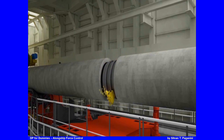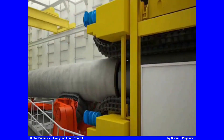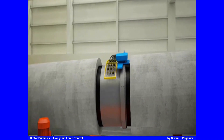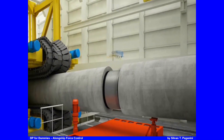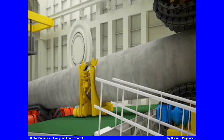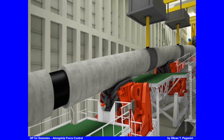In every pipeline vessel, sections of pipe are welded together in the so-called firing line or main production line. When welded, they move further down the production line, passing the tensioners — a quite important tool and sensor in the DP system. The weld is then ultrasonic- or x-ray tested for defects. The exposed steel is then grit blasted and coating is applied to protect it.